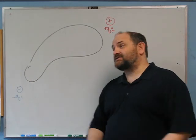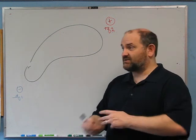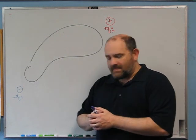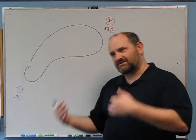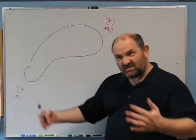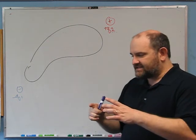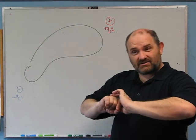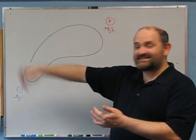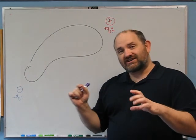The huge difference, and almost everything that we talk about with electric fields and materials follows from this difference. This is the most simple view of it, and you can find cases with semiconductors and things that are more complicated, but the quickest simple view that actually gets you very far in thinking about how materials work is that inside a conductor, charges can move freely. There's an electric field, there's going to be a force on the charge, it's going to accelerate, it's gone. Whereas in an insulator, a charge cannot move freely.